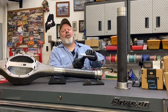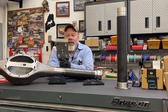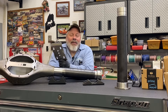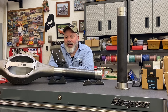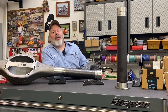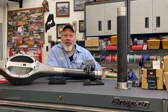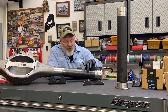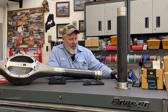I bought both half-inch and 9/16ths U-bolts. Now, this truck doesn't need 9/16ths U-bolts, but if this doesn't get them, something else will. Obviously the bigger the better, but half-inch is the norm in most of your Camaro Novas and half-ton trucks. 9/16ths is usually saved for three-quarter and one-ton stuff, but just remember it's an option — you buy a U-bolt by length and by diameter of the axle tube, and if you specify 9/16ths U-bolt, the math has been done and it still fits tight, it just takes up more room everywhere else.